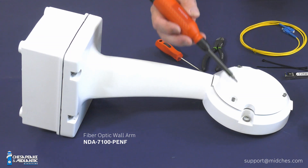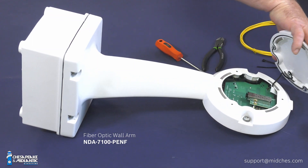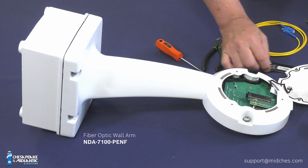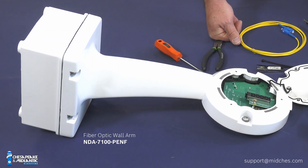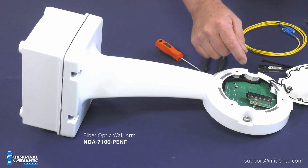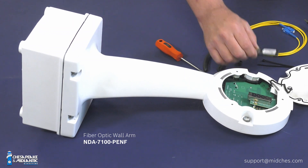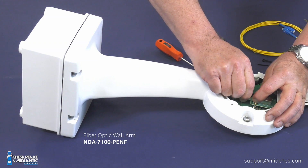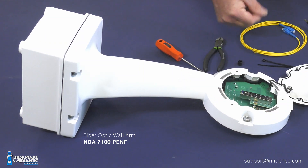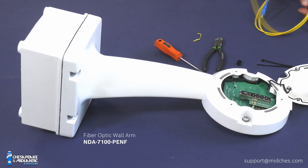For the wall arm unit, there are three security screws on top. Unscrew those three and the lid will come off. It's connected via a rubber connector to keep it from falling, since you're typically well above the ground when doing this. You see the same board on the top side. Take the protective cover off the SFP socket, push the SFP into the unit, then take your fiber cable and connect it. When the SFP goes in, the metallic Ethernet connection becomes inactive. Make sure the power is turned off before doing this.